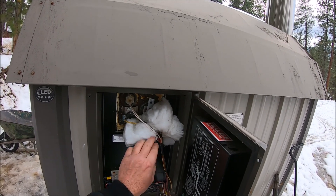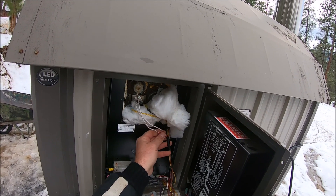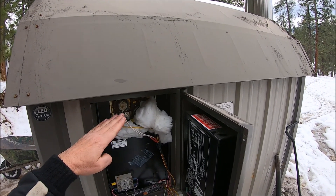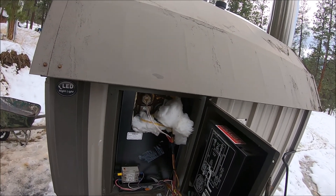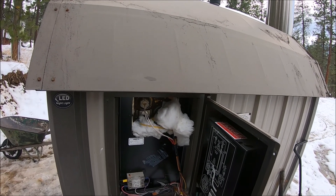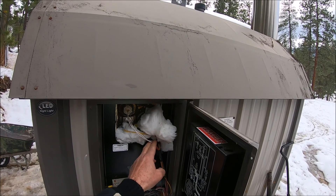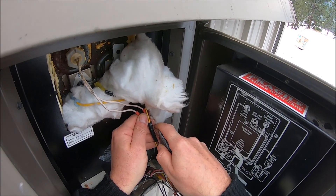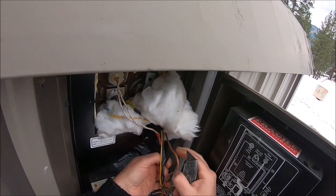What I will test is I'll disconnect these two wires and hook them together. If this is just a regular float switch, down would be open and up would be closed. So if I snip the two wires, either my low message goes away, or as I hook the two wires together the low message should go away and the boiler would function fine again — just assuming it has the correct water level because I've put these wires together. Let me get some tools out and let's get started.